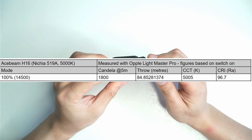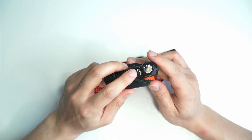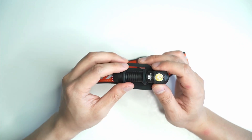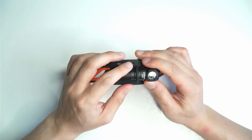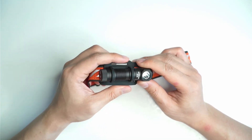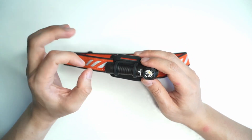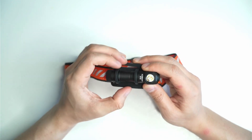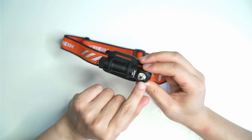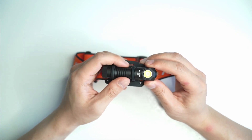At 96.7 CRI — very impressive. As expected with the Nichia 519A LEDs, the 519A is rated at 650 lumens. The beam is really unique — it reminds me quite a lot of the PocketLit AA beam. It's a very large round hotspot and I was just amazed at how smooth it looks. It's quite similar to the beam from a TIR light or even an aspheric zoomable light when you zoom it out. Smooth, even — and quite nice for a smooth reflector. Normally you get all kinds of ringiness, but I didn't experience any of that at all.